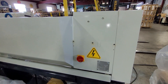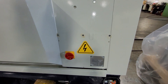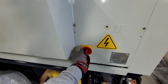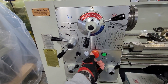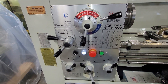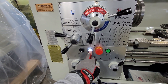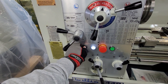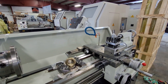This is the electro control box on the machine. Once the machine is hooked up and power is to the machine, this is your main switch right here. We'll turn that on. Now with the main switch on in the back, we'll make sure the e-stop is out. This will show you that you do have power now at the control panel. This is the flood coolant on/off, and you can see that's plumbed up to the back of the carriage. It also has a valve up there.